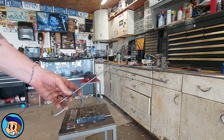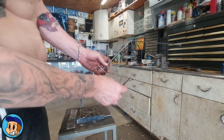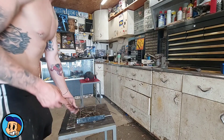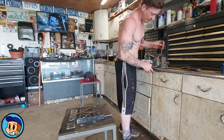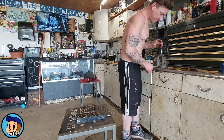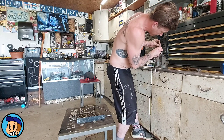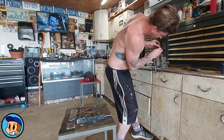At this point I get a piece of scrap that's ironically going to be the perfect size, and I do my outside loop first. I literally just take this piece and come over here — you can either smack it with a hammer or use the vice method, which works real nice because you can leave your vice a little bit loose and just work this through, slowly putting a decent bend in it.